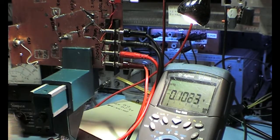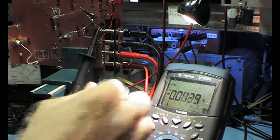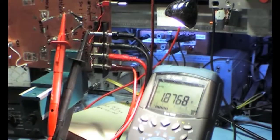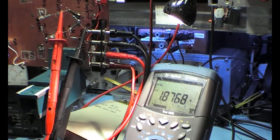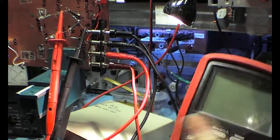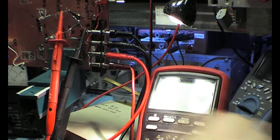And if we look at the Agilent and I do the same thing, that is a rather expensive hand multimeter, and it's with high precision. But you see the problem. I'm measuring it. You see the current going up, and you see the voltage going down. So even that very expensive and modern hand multimeter, compared to the Fluke, is making this mistake. This meter has a high impedance range, but then we have to go in the millivolts again, and this is too high for that.